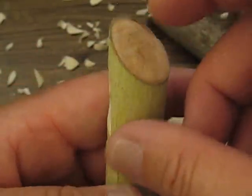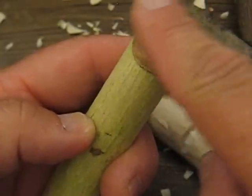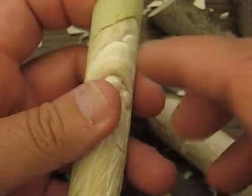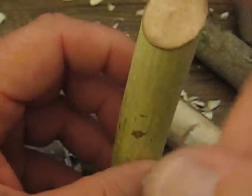What you want to do is take Elmer's glue and just really put it on there nice and even — a nice semi-thick coat on either end. Let it dry, and then you can go ahead and carve it and have fun with it. It will prevent it from splitting from the ends.